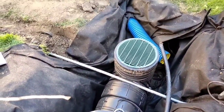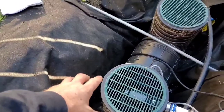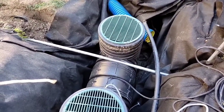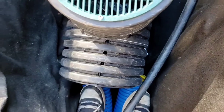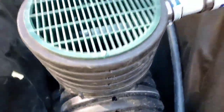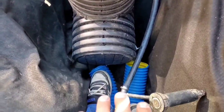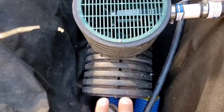This fits all, works for any application. You don't need so many places to hook up to discharge your water. You DIYers built some wild stuff and pushed us to run half-inch holes on the sides, bottom, and top - inlet all over the place. We increased the inlet by 300%. So all you have to do is run your pipes right at the bottom of the trench, have your sump pit a little deeper, and the water just falls in.